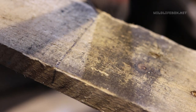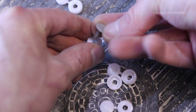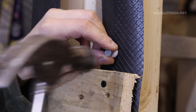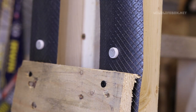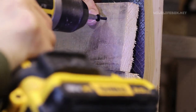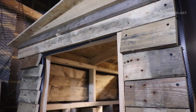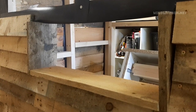You'll then need to do a lot of cutting of the pallet wood to make sure it's the right size for the different sides of the bird hide. I then used a combination of screw-hiding fixings and clout nails to hold the pallet wood slightly away from the timber — this causes the pallet to angle out a bit to hopefully drive away any water from coming inside. Continue to do this throughout the whole of the bird hide; it's quite a time-consuming process but you just got to keep going.